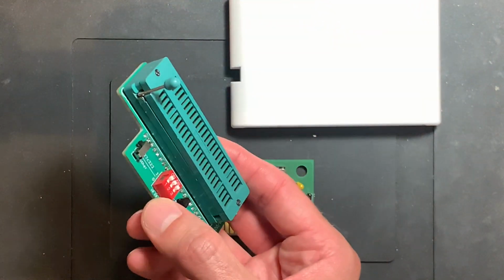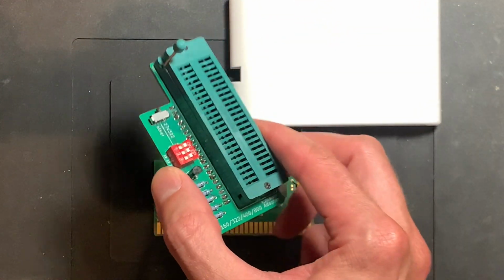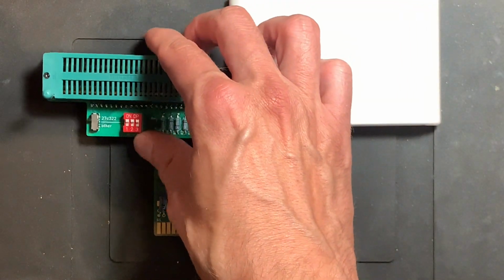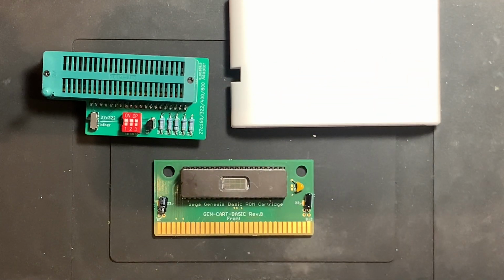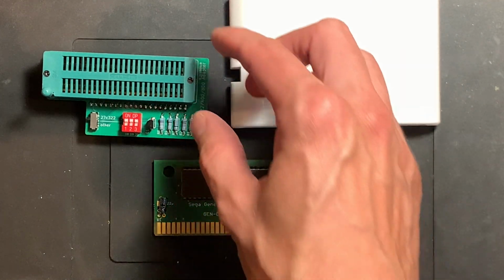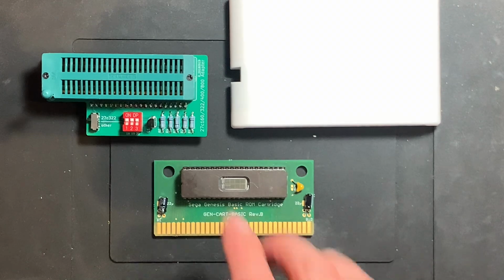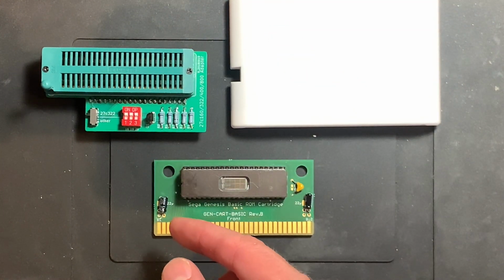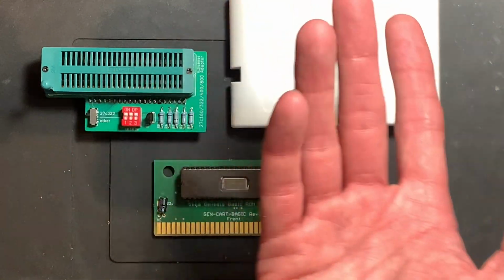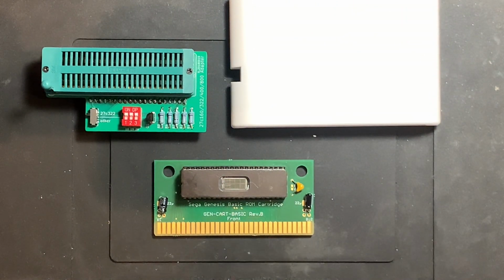And you can also use this to program different sized ROMs that are larger than 512K, which is nice. Also to read them out, to make backups of ancient systems and what have you not. Because this is of course not limited to the MegaDrive. You can use this for any kind of ROM that is 512K or greater, so that's a nice bonus. But that's it for today.